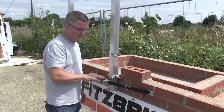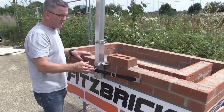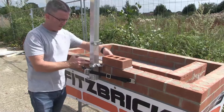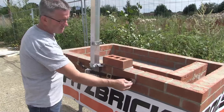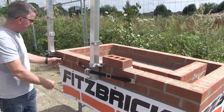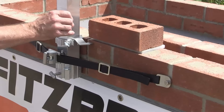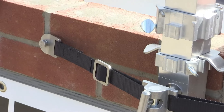This is my fixed brick intermediate profile system. It's the only intermediate system that doesn't need to cross the wall or hook to the back of the brick. Across three bricks you're drilling 70mm holes, push in your M8 pins — much the same as your externals — and force the strap back to hold the profile. It's extremely strong and very quick to put up.